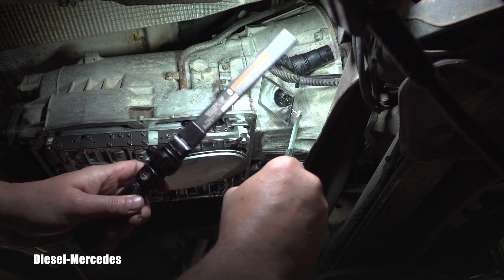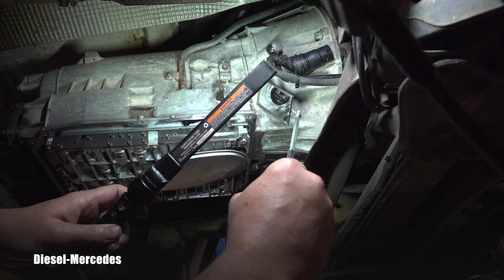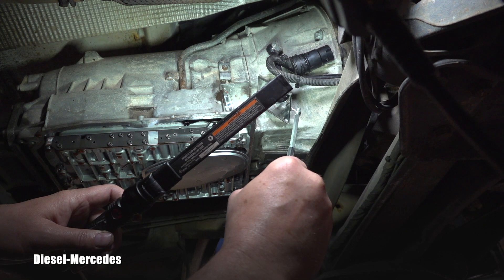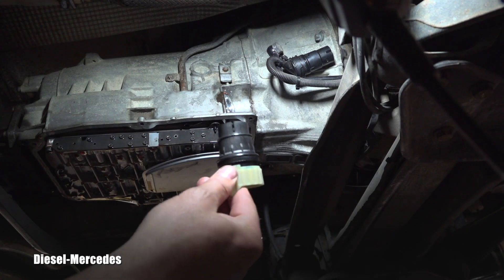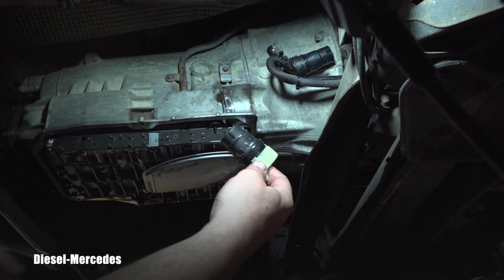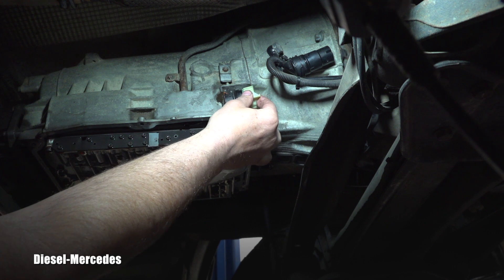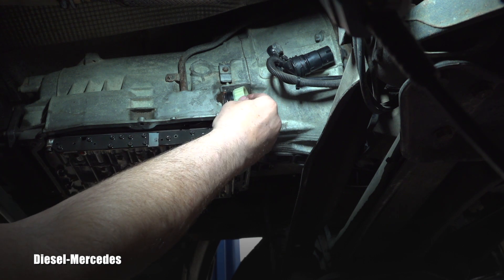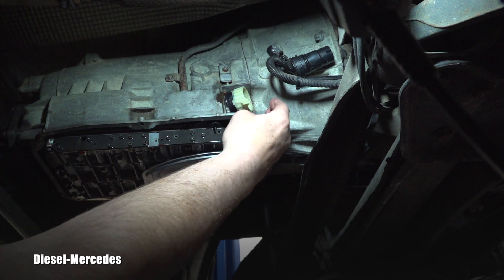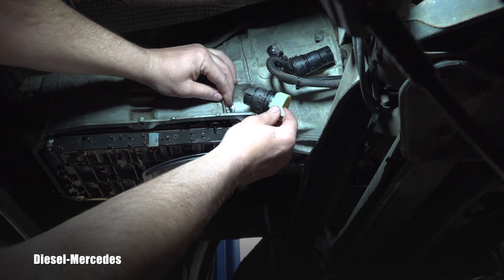I need to bring a mirror and look inside. I've looked very carefully and very gently dried it out inside. If you ever put your fingers in there, be careful not to bend the pins. You have to be extremely gentle putting the new connector in. Both O-rings are in place and haven't fallen off. I'm very carefully starting to feel the entry, and only when it goes in easily will I start pushing it in. There's definitely no place for brutality here.